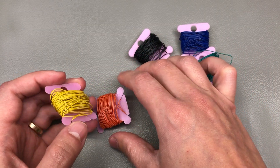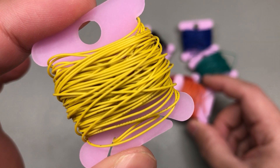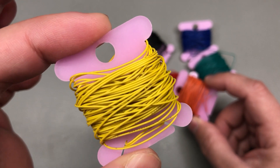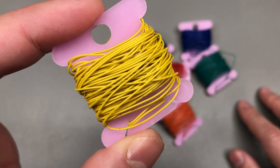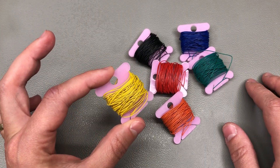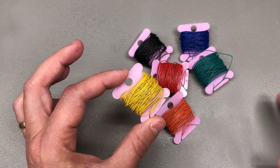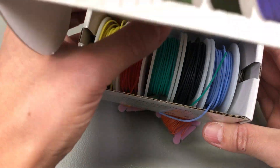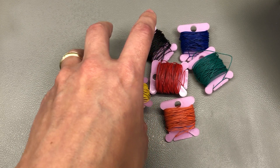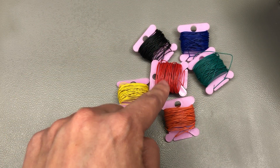Next up I ordered some 32 AWG wire in different colors — 5 meters per spool. This wire is spec'd as UL 1061, rated up to 80°C and 300V, and it does have markings on the wire itself. The outer diameter is 0.6mm with a PVC coating, and there should be seven individual strands of tinned copper inside. I plan to use this for very tiny repairs, mods, and bodges when working on PCBs. I also have 30 AWG silicone wire but that has very thick insulation, so I wanted something thin for quick repairs. I'm pretty happy with the wide selection of colors available.